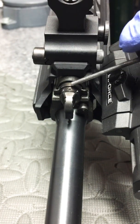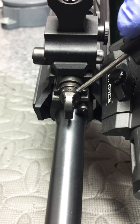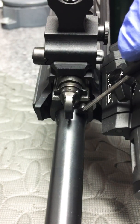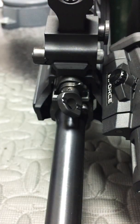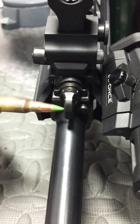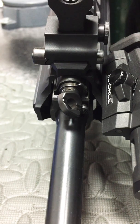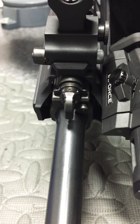To adjust this, 12 o'clock is the normal position. You do not have to push the detent to move it from normal to adverse conditions. That's done because this whole system gets carbon caked pretty quick, and to fumble with this in the field, they've set it up so you can just take your fingers and move it one click over to where your large dot's at the 12 o'clock position. Or you can use a bullet tip to click it one click over and back. You don't have to push the plunger to give it more gas — just reach up there, give it more gas, and spin it back once you don't need it anymore.